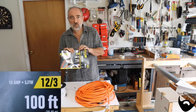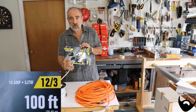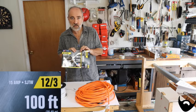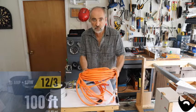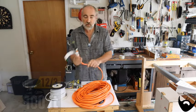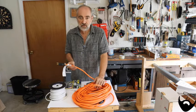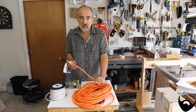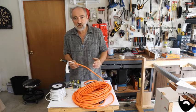You need to make sure you get a 12-3 extension cord — 12 gauge, which is the thickness of wire, but in this case it's going to have three conductors inside the cable. This is a heavy extension cord; it's not the normal extension cord you probably have in your garage. It's pretty heavy duty and it costs a lot more. I wouldn't be buying this extension cord unless I was using heavy duty equipment on the job site or building a van. All the extension cords in my garage are much lighter weight — they're not 12 gauge; they're 16 or 14 gauge.